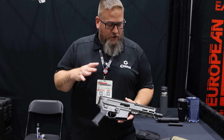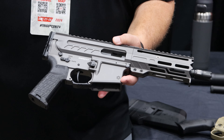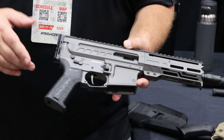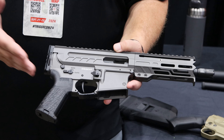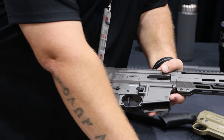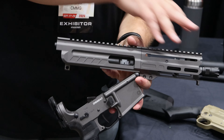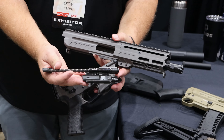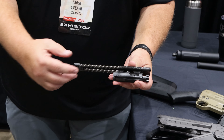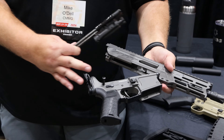When we started off we were doing short rifles — 5.56, 300 Blackout, 9mm, different variations, and 6.5-inch barrel pistols. We've added to them the ability to put a Picatinny rail on the back, so you can run it just as a pistol or with a brace. The heart of the Descent is our Compact Action operating system — you'll see a dual guide rod system, and what would traditionally be more of the bolt carrier group is modified so the entire system operates inside the upper, negating the need for a traditional buffer system off the rear.